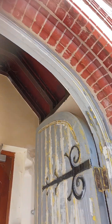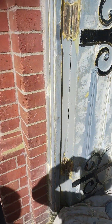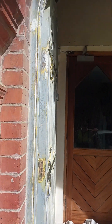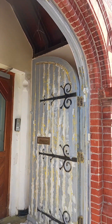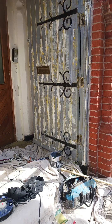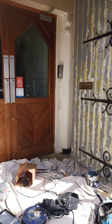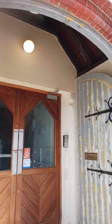We sanded it back, we put the profile back — even though I opened it up yesterday when you were here, I've gone further with it to make it kind of uniform on both sides. So once we get this primed, we'll leave it, have lunch, come back and do a little bit more filling, then start on the first tinted undercoat after that.